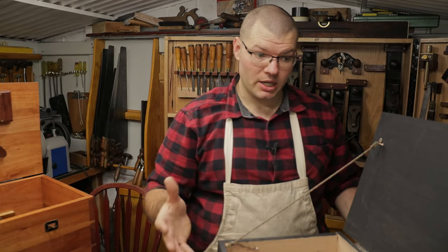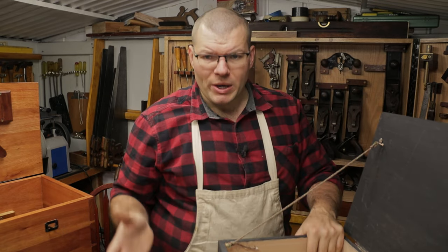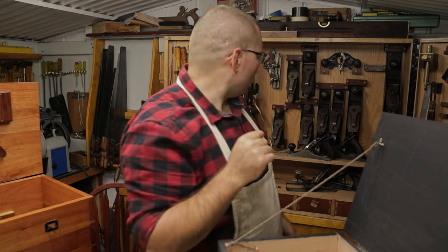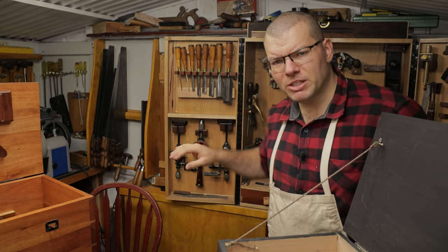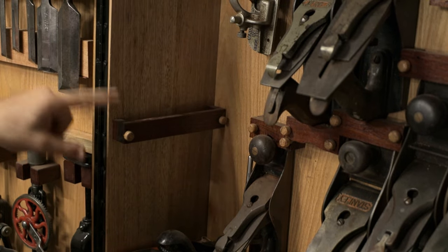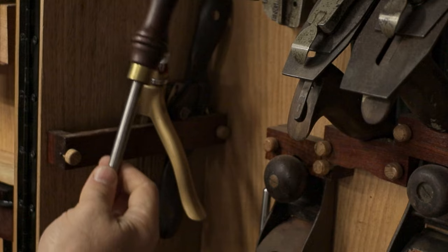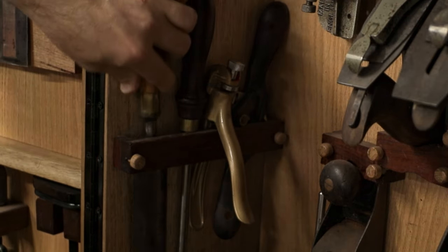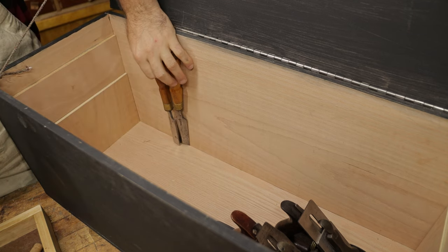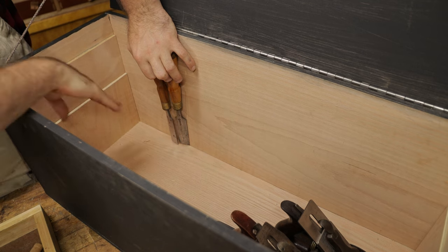You also have the option to add a little storage rack in this toolbox — similar to the chisel rack, but if you're happy to keep moving the till out you could have higher options like chisels running along the back. The type of rack I'd suggest for flexibility is similar to the one in my toolbox — it's a very open style, just a straight piece of wood with a couple of little blocks bringing it out wide enough to hold tools like a spoke shave, saw set, and any other odd shapes. You could add files in here, and this style even allows you to house chisels. With dividers, spoke shaves, and marking gauges, you could slide them into this rack along the back.